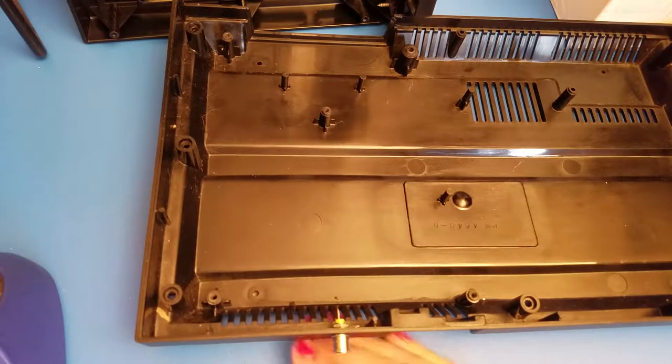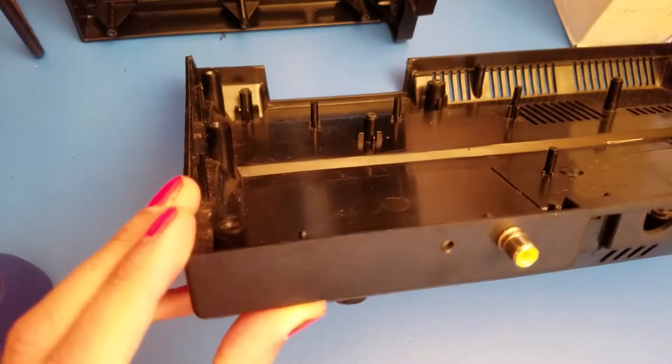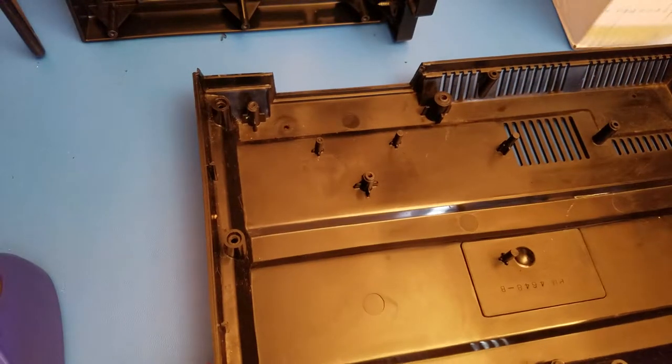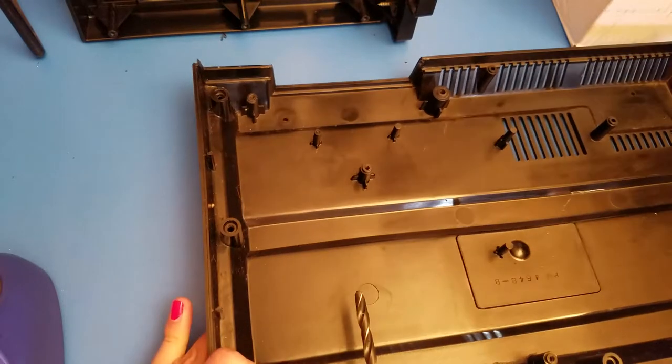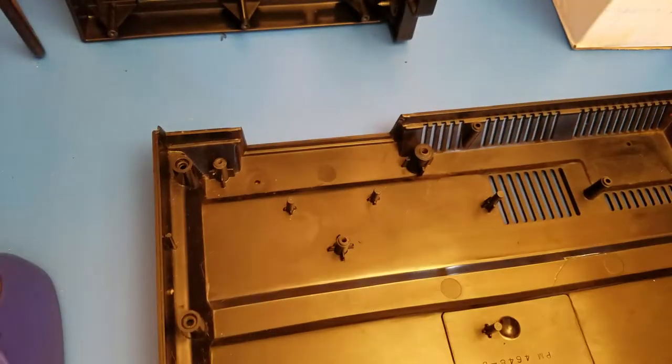That plastic. So that's the start of it. Now you want to take off your small drill bit, swap it over to your quarter inch, and then go at it again and make this hole. Basically, you're starting there so you can allow yourself a quick, easy transition into the next size. And now you have a beautiful next one right there.